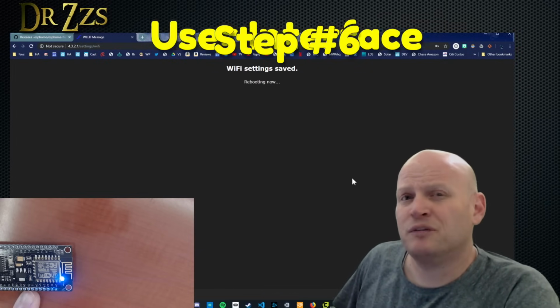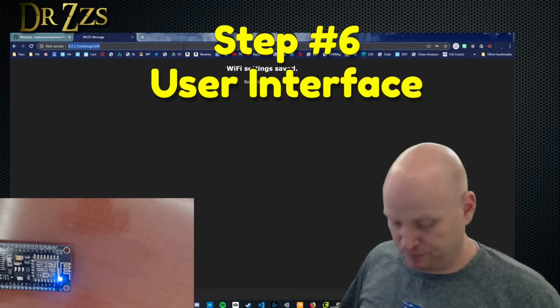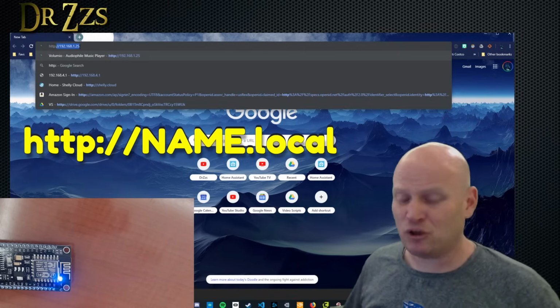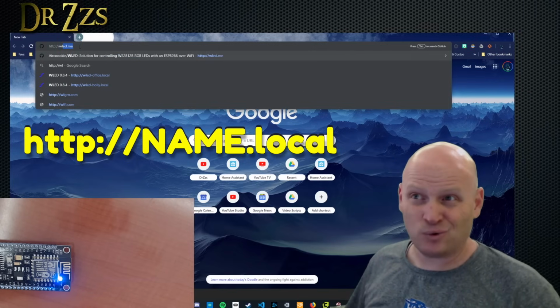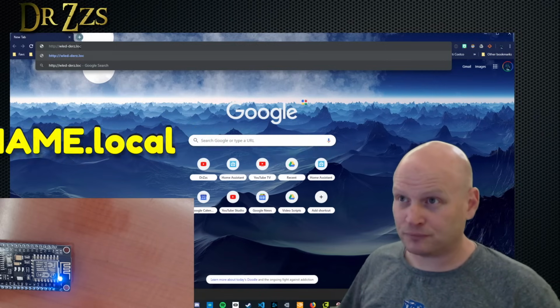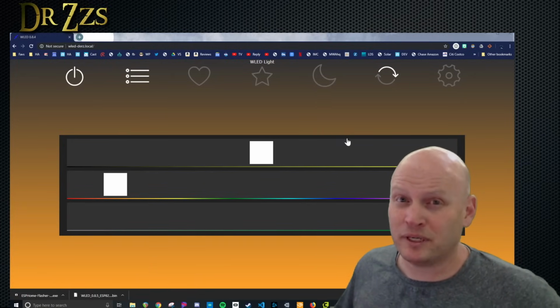Now the Node MCU is going to be able to connect to your Wi-Fi. So give it a minute, and then in the browser, type what you put in the box next to .local. You probably need to include the beginning, which was http:// and then mine was WLED-DrZz, D-E-R-Z, .local. And there it is. This is the WLED web interface.